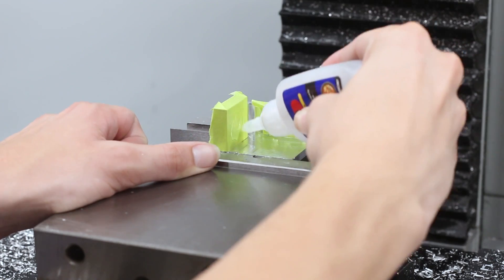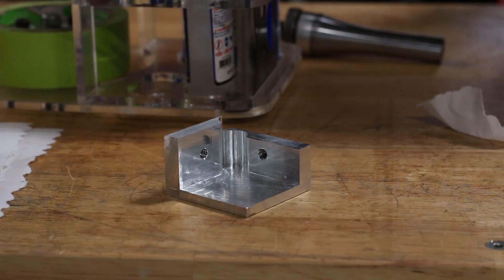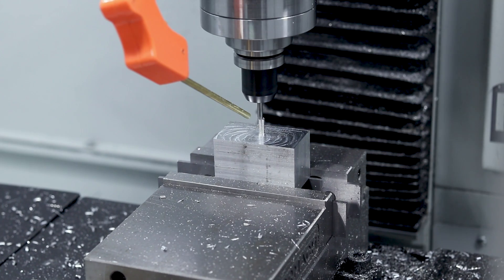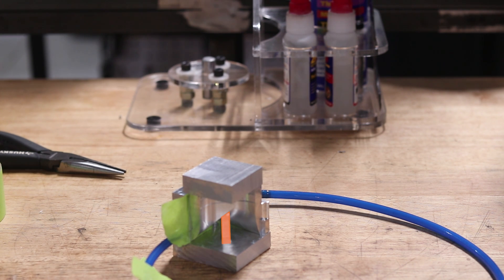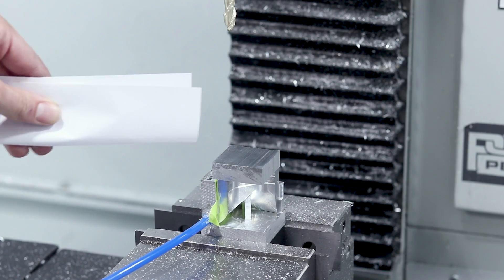When we had tried super glue alone it didn't work. We tried adding air vents to keep the fixture cool so that the adhesive on the masking tape didn't fail from built-up heat. And then he realized: I can both add a thread to my Op 1 part that massively increases the rigidity of the work holding, and we can custom machine a fixture that's going to help that Op 1 geometry nest into this fixture and really increase the overall strength.